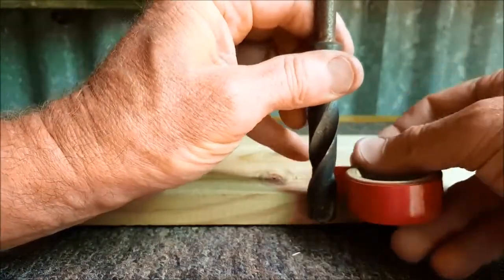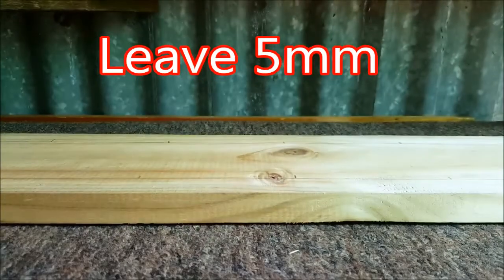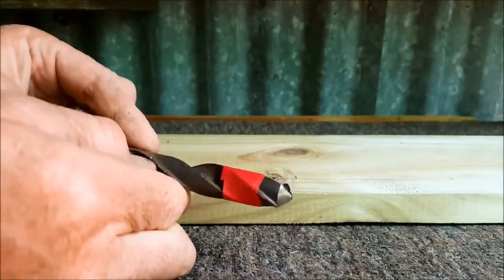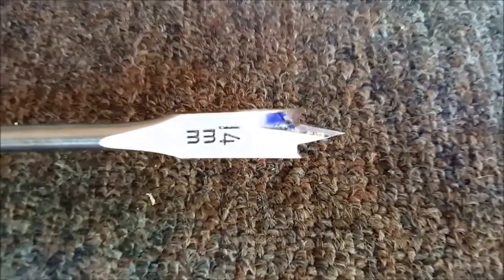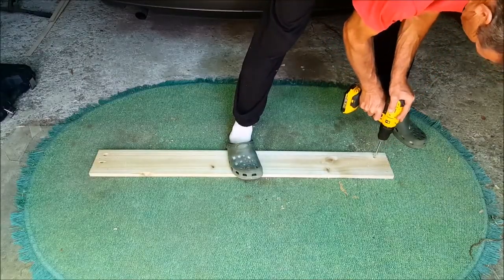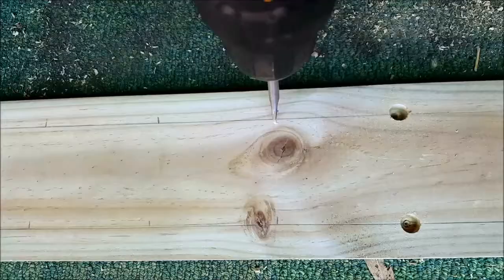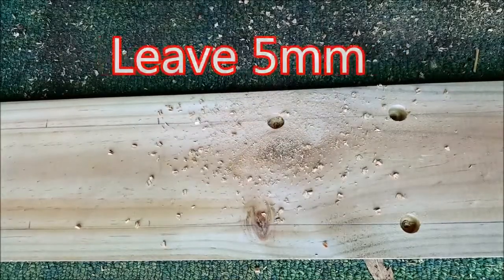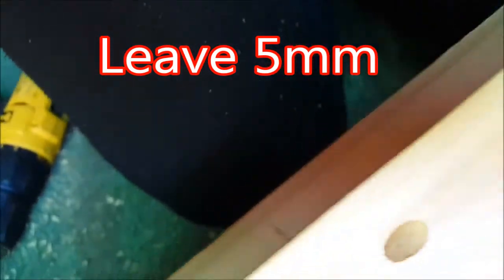Now to drill the holes in the piece of wood for the dowels. Don't drill all the way down — leave about 5mm on the bottom. You can do this by marking with sticky tape, so you know when the drill bit has gone far enough. Make sure the drill bit you're using is 1–2mm smaller than the dowel diameter. Here I'm using a 14mm spade bit for my 16mm diameter dowel. Now go ahead and drill the marks for each water bottle — as you can see, you don't drill all the way through; leave that 5mm base in each hole.